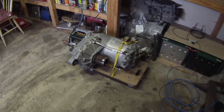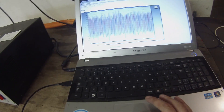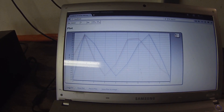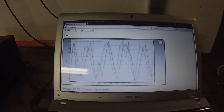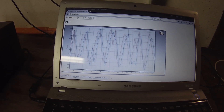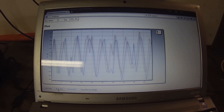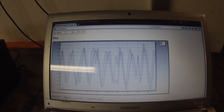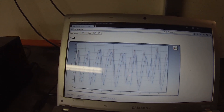This is about where we're at. We've reassembled, running some tests here, and we've gotten some very nice plots. Our current sensors are just working away fantastically — you can see how closely together they track. Right now we're running peaks of about plus and minus 25 amps per phase into the motor, getting some very nice readings from that.